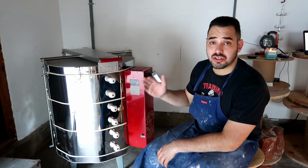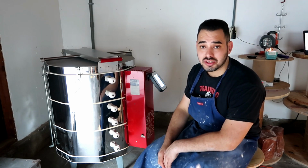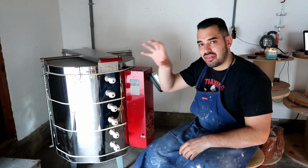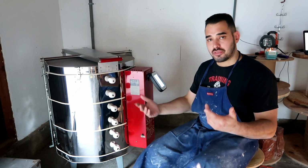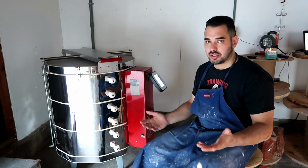You go over to that box on the side of your house, usually somewhere in your backyard or at least on the side of your front yard or house, and then you open that up. Somewhere on that, it'll say how many amps that box can give. Newer ones usually give about 200, but mine is a bit of an older one. It gives about 100.